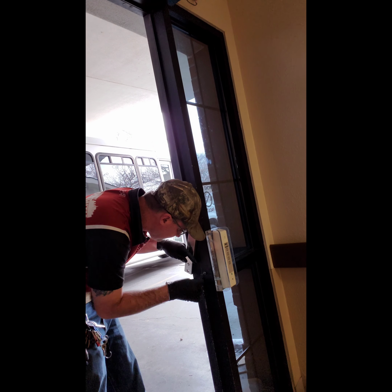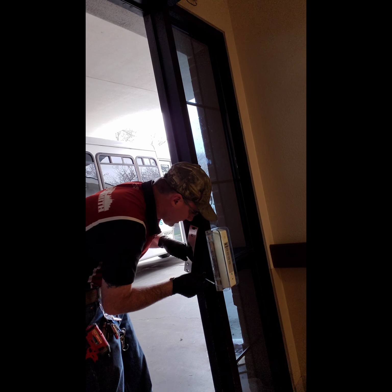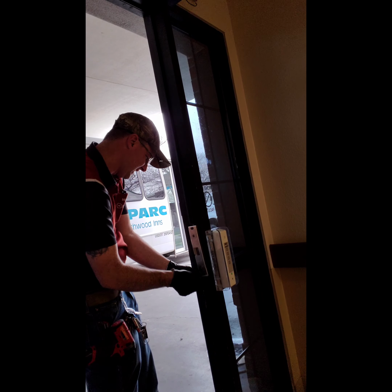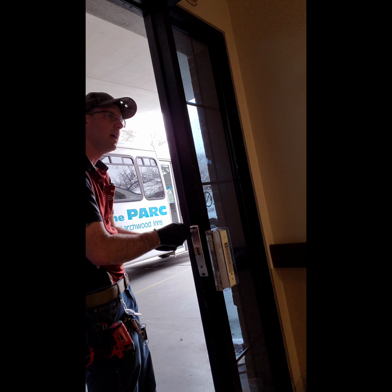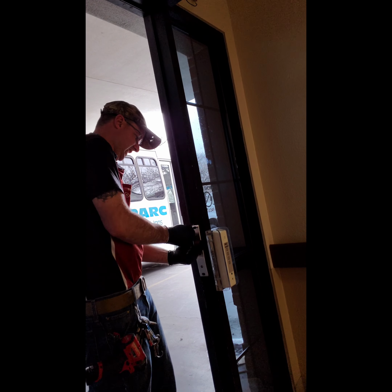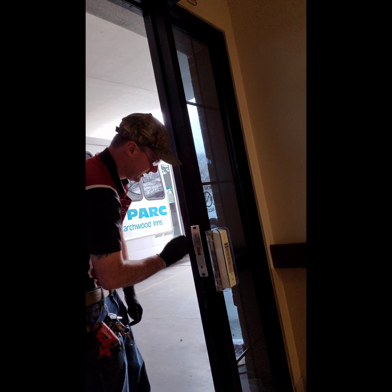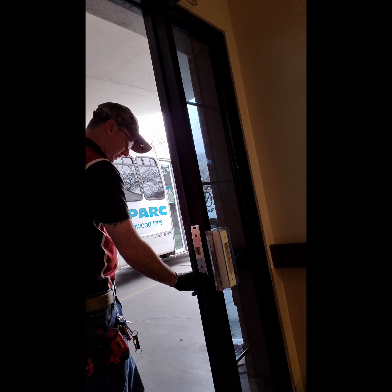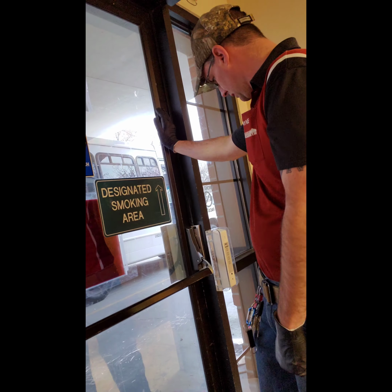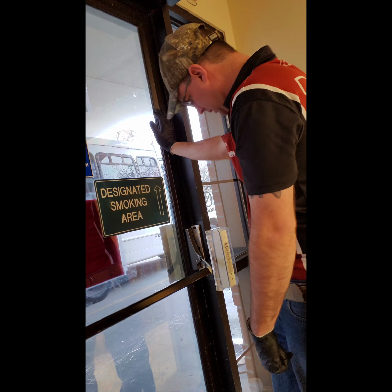So you could also do the nut zerts for the top and bottom mounting screws that are adjustable, and then if you wanted to just tap the actual aluminum for the other 2 final resting strike bolts, I think that would be plenty sufficient. You could nut zert them as well, but it's going to be more difficult and there's going to be absolutely no movement after that's done. And if you mess up a nut zert, you kind of really limit your options if you mount it in the wrong location.